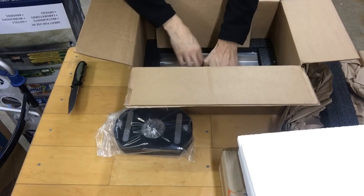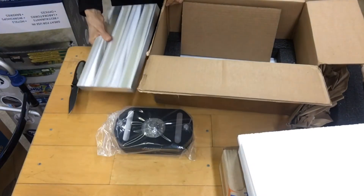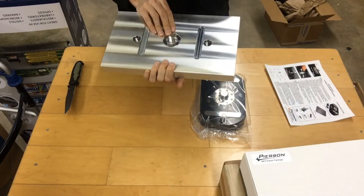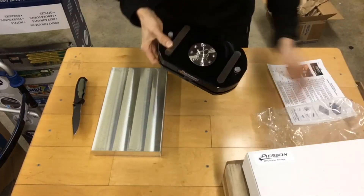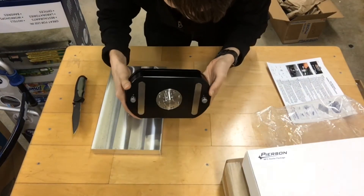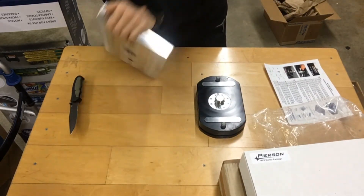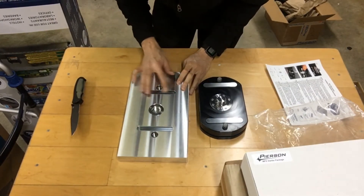I got the wide pallet because what we're going to be machining is just soft materials, so I don't really need the rigidity. It's a solid chunk of aluminum. The base has some stainless pads here and here — those are wear resistant — and then it has these locking pins. I was wondering if the pallet had stainless pads too, and it doesn't. It's just an aluminum pad surface.